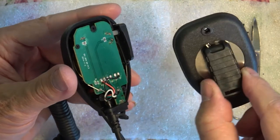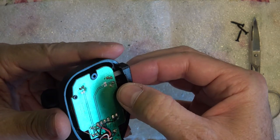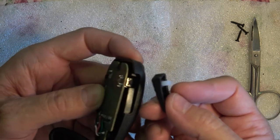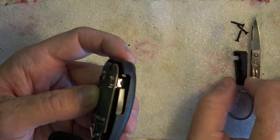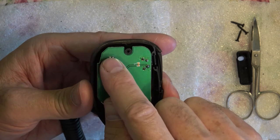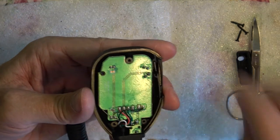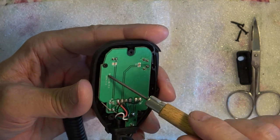Now you've got a push-to-talk switch here. It just sits in there — it's got a little silicone plunger. Don't lose that because that's what pushes down on the push-to-talk button right in there. See that push-to-talk button there in the center? This is what pushes down on that. Let's set that aside. Now these circuit boards sometimes come with a screw here and a screw up here. Sometimes there's no screws whatsoever and they just put a melted piece of plastic to secure the thing. Other times there might be a screw somewhere else as well, depending on the model of Baofeng circuit board you have — they come in various different ones.